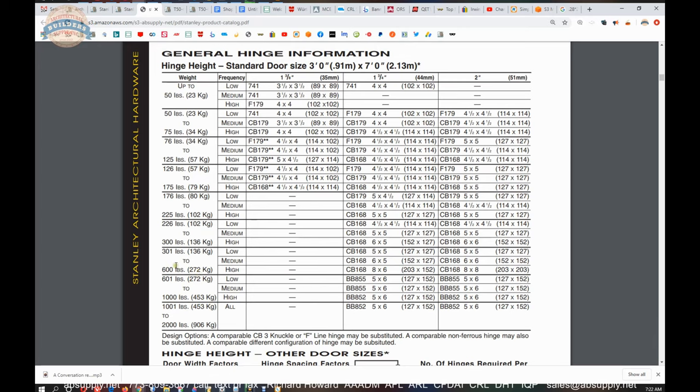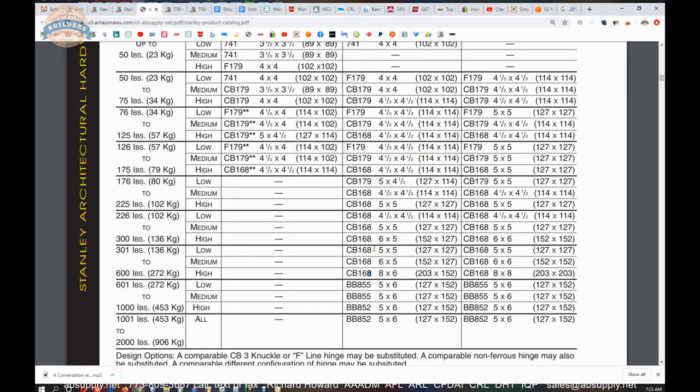A client recently asked me about a door pushing 600 pounds. When we look at what Stanley has tested, 300 to 600 pounds with a given frequency of use, here's the hinge they want you to use. Here's an interesting fact: 70% of the weight of the door is hung by the top hinge. You'll see how the hinge height changes — 5, 6, 8 inch tall — as frequency goes up, because a taller hinge is substantially more capable of carrying the weight. As for width, a wider hinge actually works against you because you want that vertical axis of pivoting to be as close to the face of the door as possible.